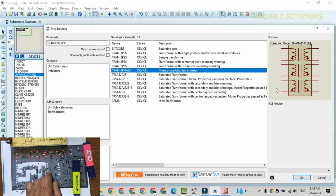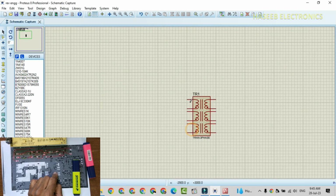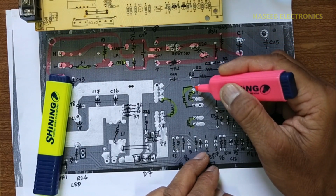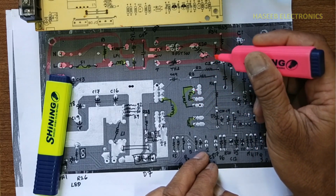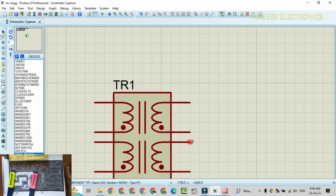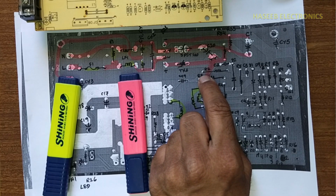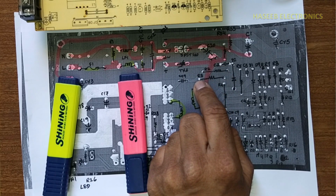We will use this 6 winding transformer and we will leave 2 windings blank. Now we will connect this positive voltage to the transformer primary and reset winding, or tertiary winding. Here I will make a jumper between both windings. Now these are connected to the positive terminal. In the positive terminal we have three components: one capacitor, one resistor, and a second resistor,